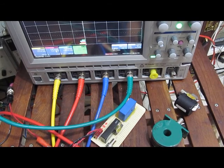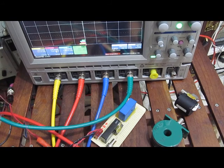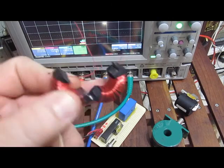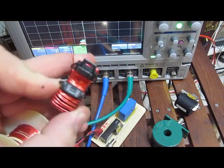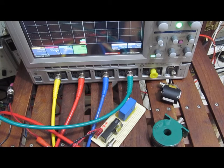Hi again. I thought we'd do a little video on current transformers. Somebody on EEVblog had asked about low-cost current probes for oscilloscopes — specifically about using an off-the-shelf split-core ferrite, something you could clamp around a wire. I referred them to an article published by Kenneth Wyatt, which I'll post a link to. In that article he was using the current transformer for debug work, so he wasn't necessarily concerned about the flatness of the signal. He made that probe out of just using the standard Steward part, and I've reproduced that the best I could and will demonstrate it against some other normal current sensors.